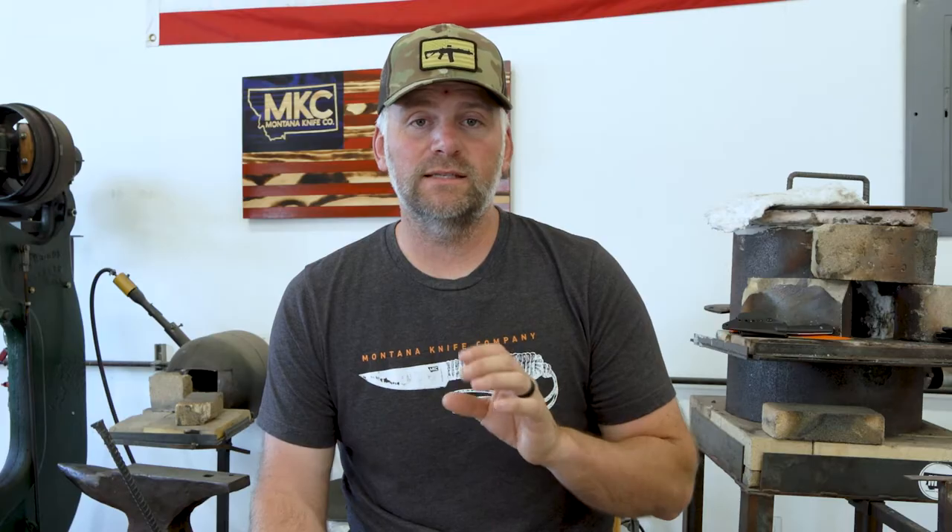The carbon portion of that steel is what allows it to harden and be useful in a knife blade. Mild steel, for example, where you do ornamental ironwork or use it on bridges, doesn't have a carbon content. The one drawback to carbon is it can make a knife brittle, or it can make any other kind of steel brittle when heat treated improperly.